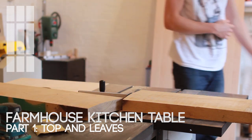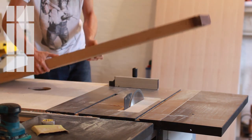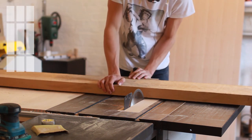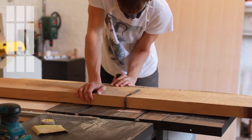First I cut the 8-foot boards into a 2-foot board, 4-foot board, and 2-foot board in sequence so that when the leaves are installed the grain will be continuous. I initially used my circular saw but it couldn't cut deep enough in a single pass and was a little underpowered, so instead I used the mitre gauge on the table saw. A cross-cut sled would have been much easier though.